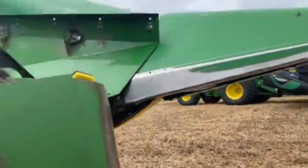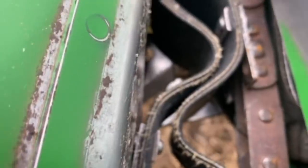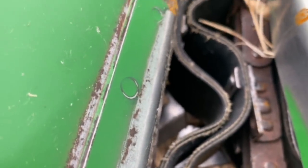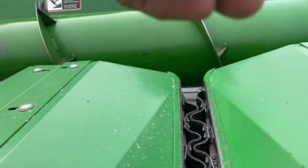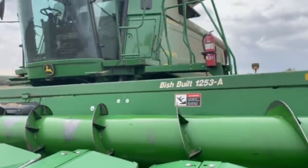Obviously it's for 30 inch rows. And then you have your gathering belts in the center and you can see down in there. And then when it cuts the bean, it rides up in those belts like little soldiers. It hits the auger, beautiful feed, and away they go. That is your row crop head,